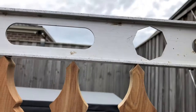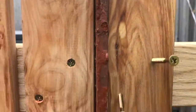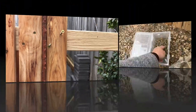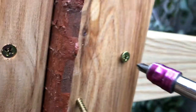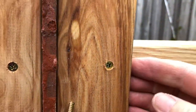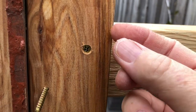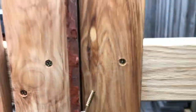All I've got to do now is lift this up and bring it up to touch. You don't want the spirit level to lift because that'll take it out of level, so you just want to bring it up just a touch — that's perfect. Pull in hard against that and then drive it in. I'll drive one screw in and show you: screws have a little bit at the end where there's no thread. As I drive this screw in, it pulls up nice and tight against the board. If it was thread all the way, any gap would be maintained as you screwed it up. But because you've got that smooth steel shank it doesn't grip in this board and allows it to pull up tight — that really helps.